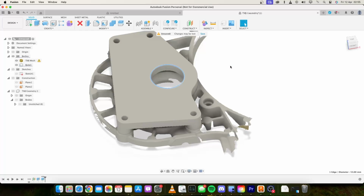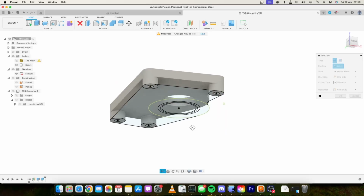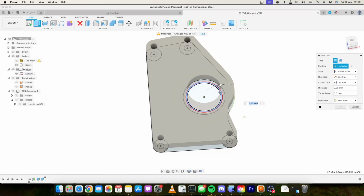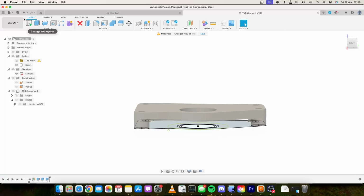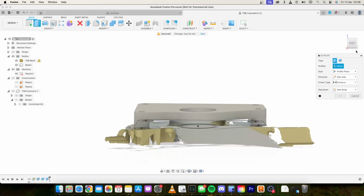Now, that 53mm probably shouldn't have extruded that up. So extrude, bring the sketch back in. We can actually select that part there, which is the bit we didn't want to extrude. Bring it up and do a cut operation. So now we have got 58mm, which is the outer section of the protrusion. Now we want to go down roughly the seal depth of that. Yeah, okay. Bring that in and we can work off that.